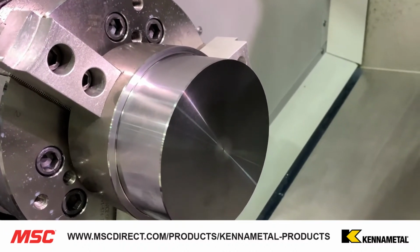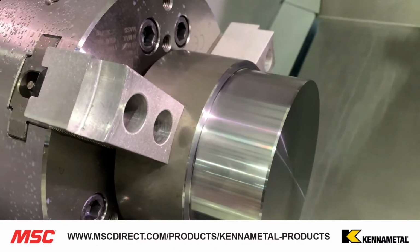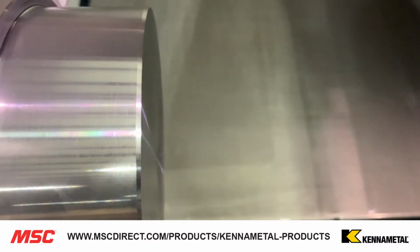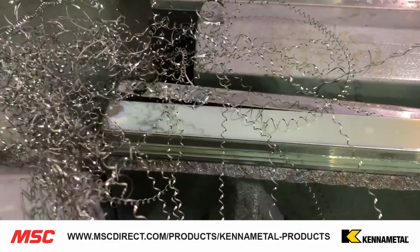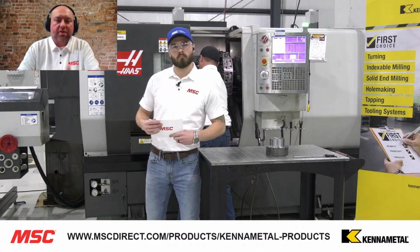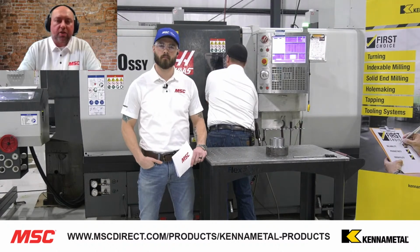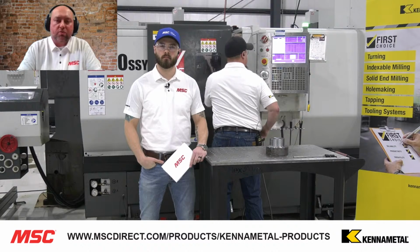And Chad, if you want to go ahead and start talking about the next grade. Because like we mentioned, this higher technology, creating capacity in this machine, we're going to produce this next part much faster. Right. And again, what you want to do here is optimize your tools and process for the job. This is a continuous turning application. There's no interruptions, no varying depth of cut, no casting scale. So you can really get after it.